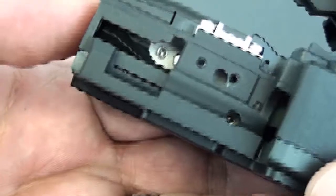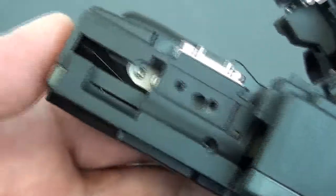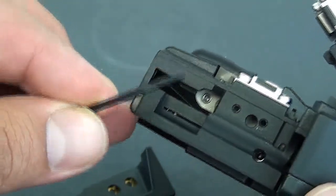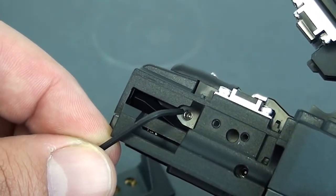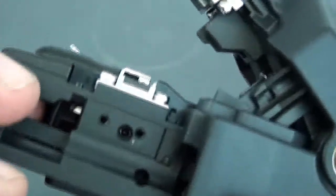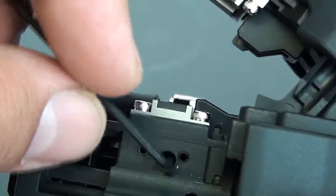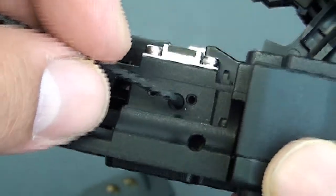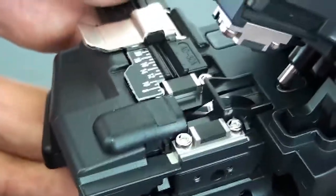Now you'll notice that there are a couple of screws. This screw right here is actually to loosen the blade. So what you're going to want to do is lock it into place. You'll see there's a nice slot for it right there — you're going to put your wrench right in there, give it a counterclockwise turn to loosen it so that you can then rotate that blade. Now the blade is numbered — 16 numbers on it.